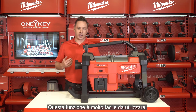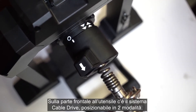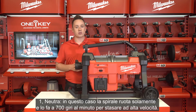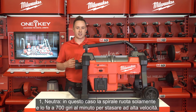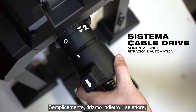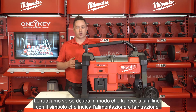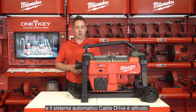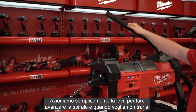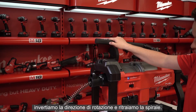How to use this feature is quite easy. At the front of the tool we have our cable drive, which has two positions. One is neutral — in this case the cable only spins at 700 rpm to work those tough clogs at high speed. The second position is the cable drive: pull out the cable drive, twist it to the right so that the arrows line up with the signs indicating forward and reverse, and now the cable drive is activated. Simply push down on the lever and the cable is fed forwards. When you want to retrieve the cable, switch the cable direction, leave the cable drive as it is, and it retracts the cable.